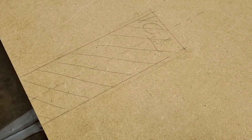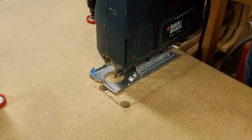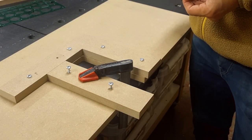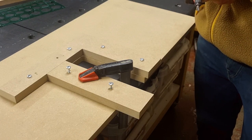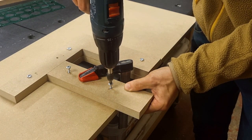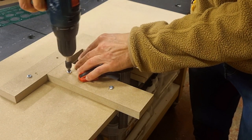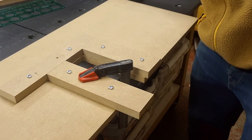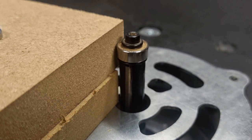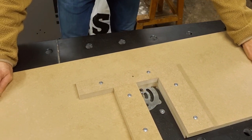I start by laying out the cut on my base material, then drill two holes in the corners and remove most of the waste using a jigsaw. Since the top will be covered with laminate later, I don't need a fancy router template. Instead I take some pieces of scrap with straight edges, use those as a template, and screw them directly into the top — those holes will be covered later with laminate. Then I head to the router table and use a bearing-guided trim bit to route my shape using these screwed-on pieces as a template.